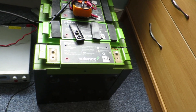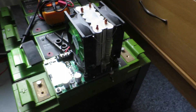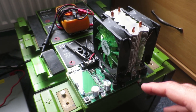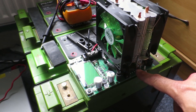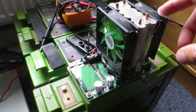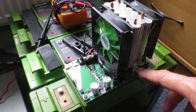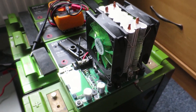What I've got here is my gizmo that will discharge the battery and tell me the watt hours or amp hours it managed to get out of the battery in total. You can buy these on eBay — they're fairly cheap, about 20 to 25 quid. This is actually the third one I've owned because the other two failed where the heat sink contacts the device that generates heat. So I took the heat sink and fans off and placed an additional copper plate in between with some heat transfer adhesive, which makes it much firmer.